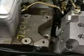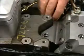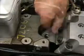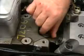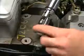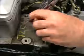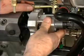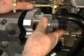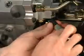Connect the upper support bracket to the high-pressure pump head in the following order. Connect the bracket to the pump head, installing the bolts finger tight. Connect the upper support bracket to the cylinder head and torque the bolts to specification. Torque the bolts holding the support bracket to the high-pressure pump head. Reinstall the fuel pump actuator housing, fuel lines, and wiring using the procedures given previously in this training. Reinstall the fuel pump drive gear cover.